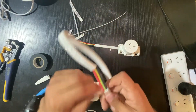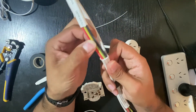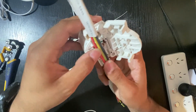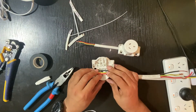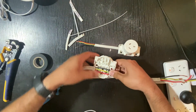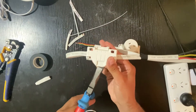Just like that. As you can see I've got my active, my earth, and my neutral. This one has active, earth, and neutral, so you can adjust and twist it so the active lines up with the right mark. Push the cables in with your finger and make sure you place them on the right spot — neutral to neutral, earth to earth, active to active — just like that. Now press it in, and you can use your pliers if it's a bit tight.